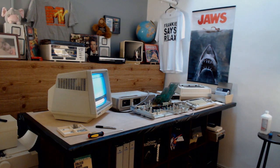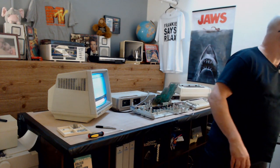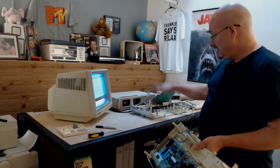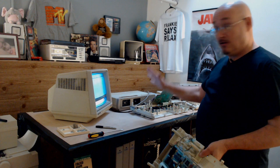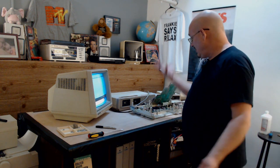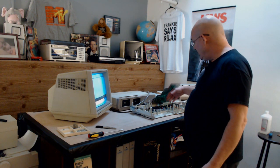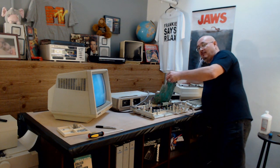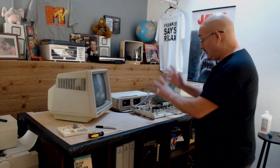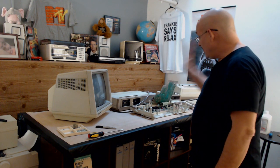So that's when I took the 6801, taking a chance on burning it out, out of this other board here. I took that one out of the other board here, tested it in there, booted right up, no problem. All right, we've identified the issue. Then I went digging in my spares and I found another Adam board, which I can't use because the connector cable was destroyed and a couple of chips are burned out, and I should shut this off right now. So I pulled it out of there and I tested it, worked great. Then I put a data drive in here, hooked it up, booted up, worked great. So we identified the issue.